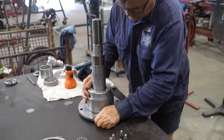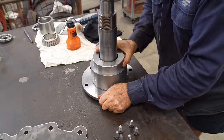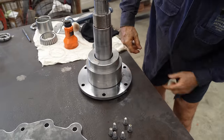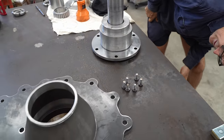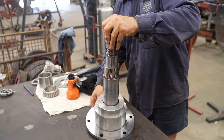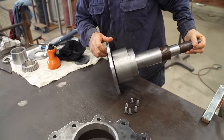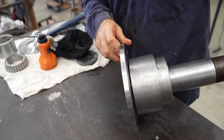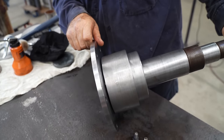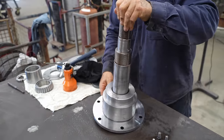That should all turn — it's a bit firm. So that turns on there, we've got our seal in there, that's down tight. There's a 3mm gap here between the two, so that part's done. It's probably just got another 1.5mm to be tapped in, but when we tighten up the final bearing that should all pull in nice and tight.